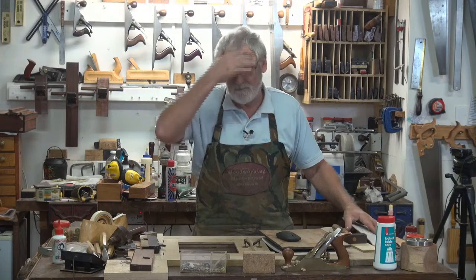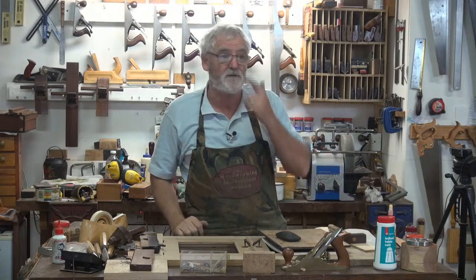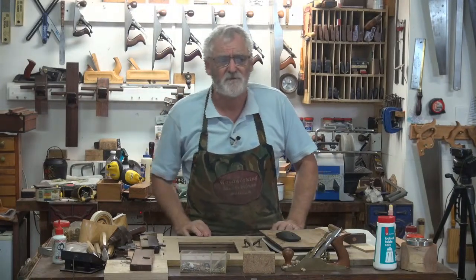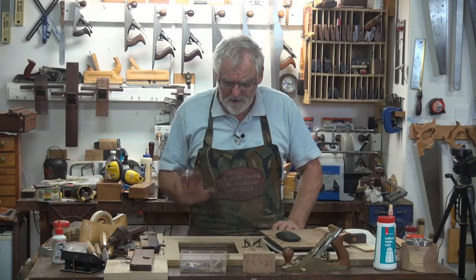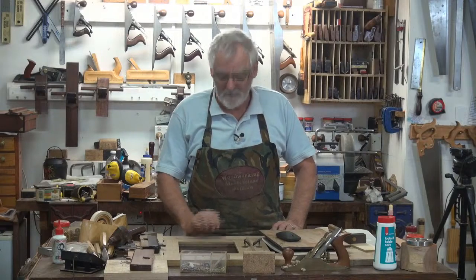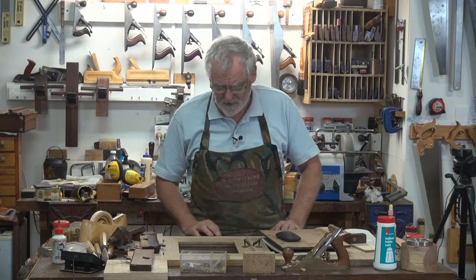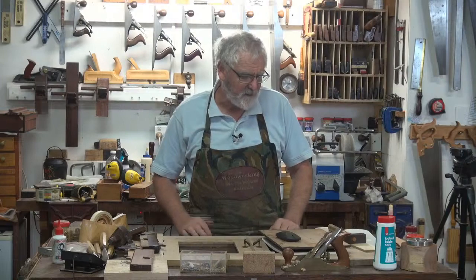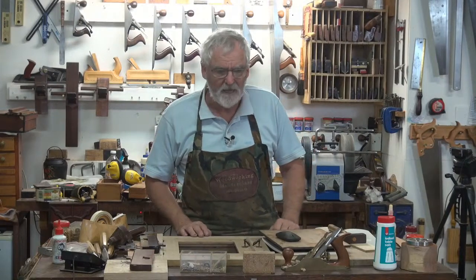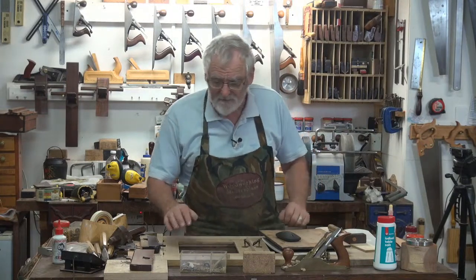But as you can tell, you see these woodworking videos, even mine, on YouTube, and you say, oh, yeah, it's an 8-minute video and I've built a bedroom suite. No, it doesn't happen. If I wasn't talking, I could do this a little bit quicker, not much quicker, but there's a couple of other refinements I've got to do to the doors, which I'll show you later on. And then I've got to wet it all down and sand it back, wet it all down, sand it back, and then we'll stain it to match the rest of the carcass over there. And we're well on the way to getting it finished.